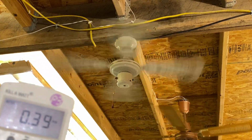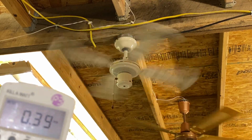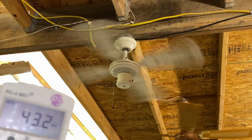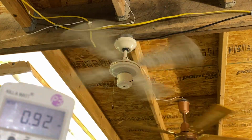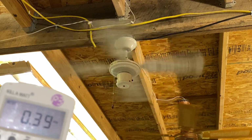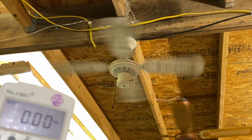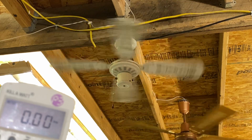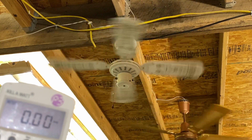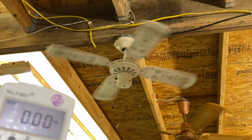It's definitely what I think of as a residential spinner motor. A lot of your builder fan type airflows. So let's see what it does for watts. 43 watts. Same power factor. Well, here is spin down. But this is just like a CEC Georgian. That's another I would find in those same kind of places installed. Or sometimes an SMC Laguna, especially the later ones.